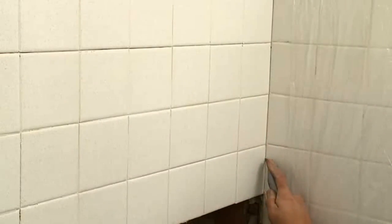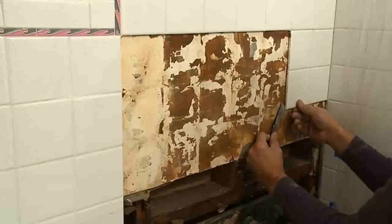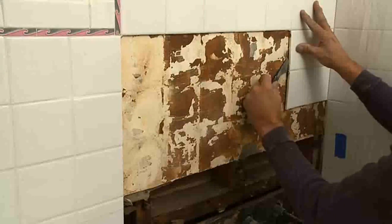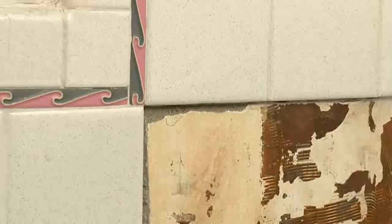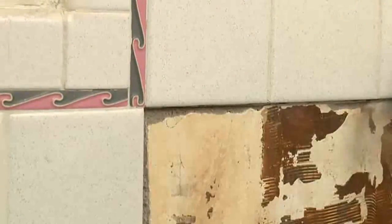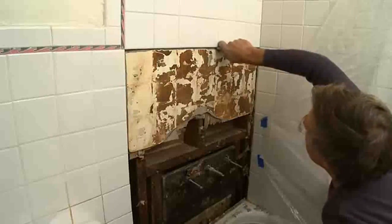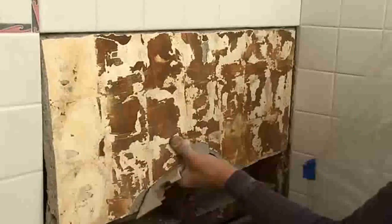This is equally important in the corners, where we don't want to damage the tiles on the back wall. Once the grout is cut back, use a small, thin-bladed pry bar to carefully pop the tiles from the wall. With the tiles removed, use the utility knife to cut through the wallboard along the surrounding perimeter — make a series of light, straight cuts, slowly cutting all the way through. You may find wallboard, greenboard, or backerboard underneath. If the area to be removed is large, cut the backing into smaller sections for easier removal.